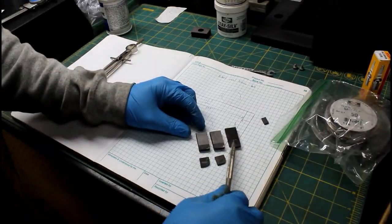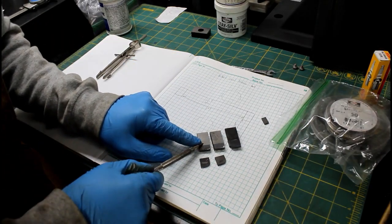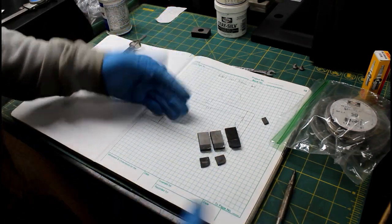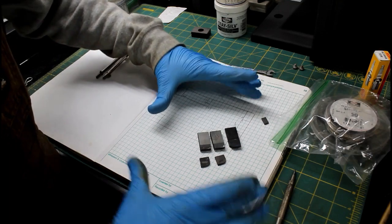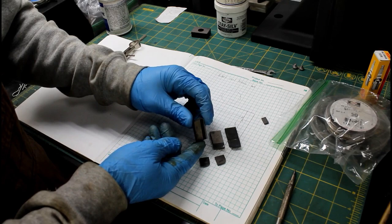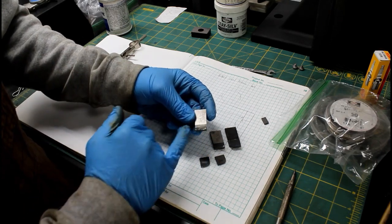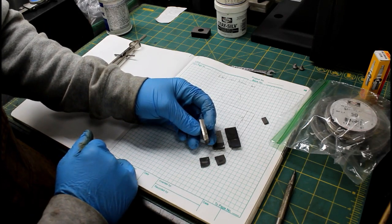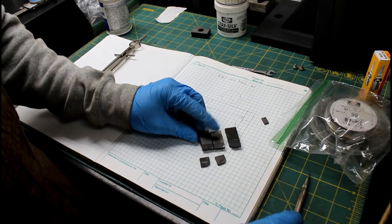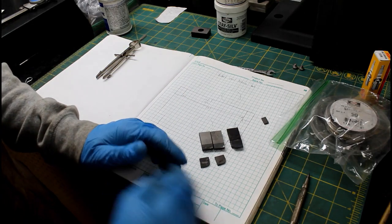Alright, so I've got 3 inserts here that go into a large face mill. The date on these is the second month of 1973, so they're substantially older than I am, and you can't buy these anymore. These were sent into the channel by Tom Fleming, and they go in a large face mill. And without repairing these, which are pretty unique, really, the whole setup's junk. I guess that's a tool steel body with a brazed-on carbide chunk there for the cutting edge. These are all busted up pretty bad, and they can't be repaired other than putting on some new carbide. So that's what we're going to try to do.